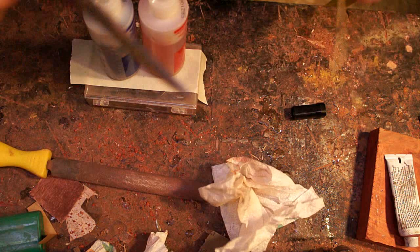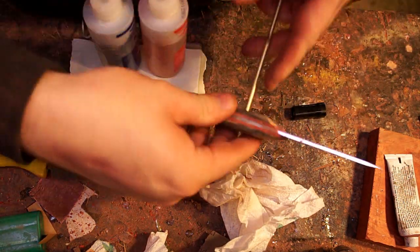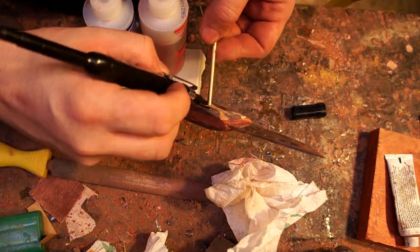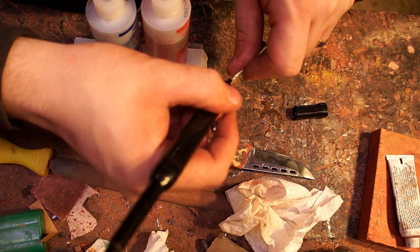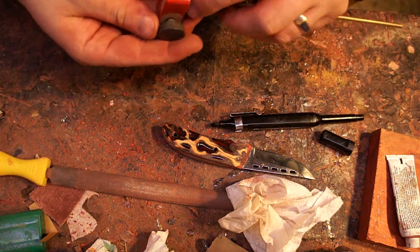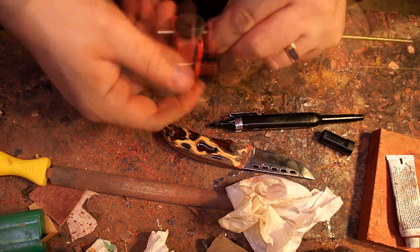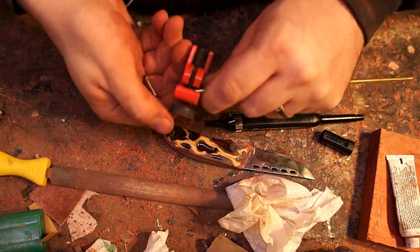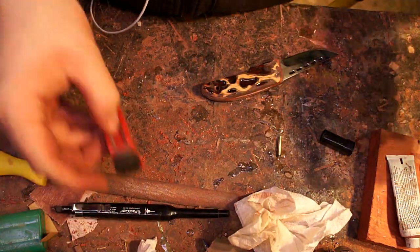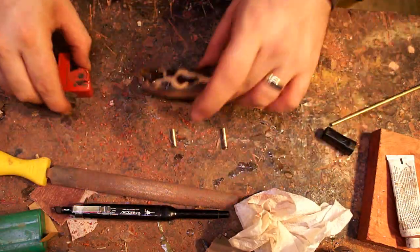After a quick trip to the hardware store I got the right stuff — I went with hollow brass tube, figuring it fit the knife better to be able to see all the way through than having a solid pin. Figuring out the thickness I need, marking it out, and cutting it. I end up using a brake line cutting tool — seems like whenever I use a saw or snips I end up goobering up the ends. This does flare them in a little bit, so just cut a little bit extra so you can grind it off.